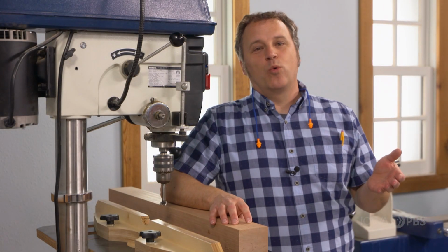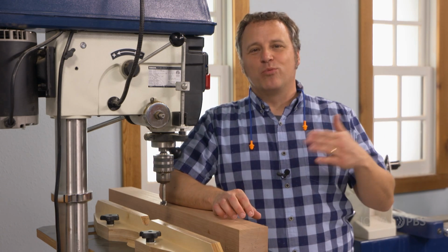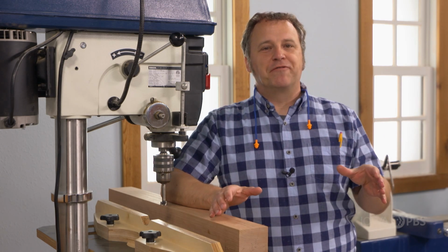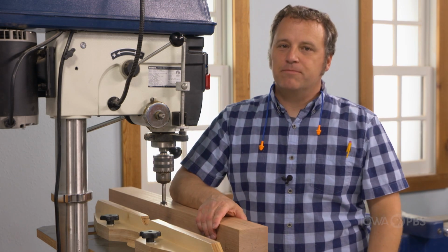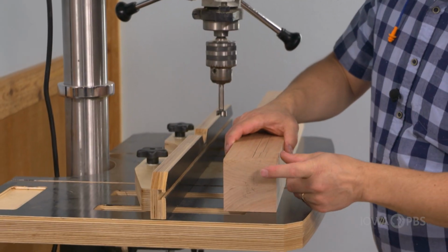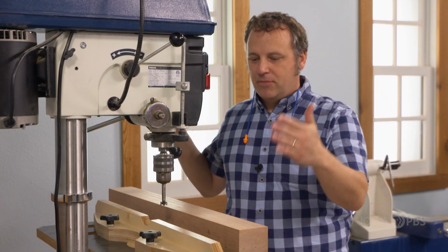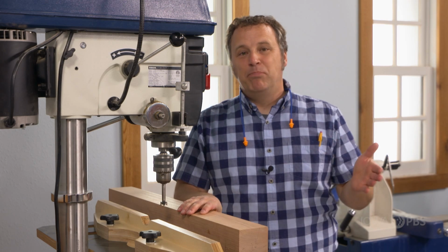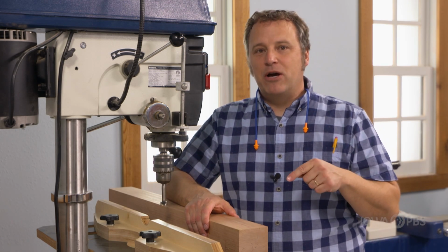The base of our workbench consists of 4 really stout legs joined with rails and aprons to create a framework. Inside that, we're going to put a box with drawers. I'm getting started here with the legs. We're gluing up 2 thick pieces of cherry in order to make each leg, squared them up, cut them all to the same length. The focus now is on the joinery, and that's what I want to talk about here.